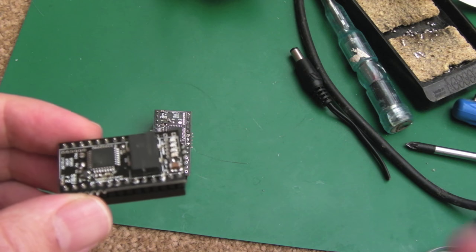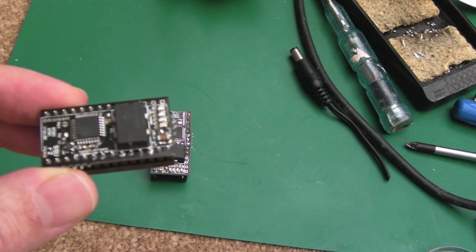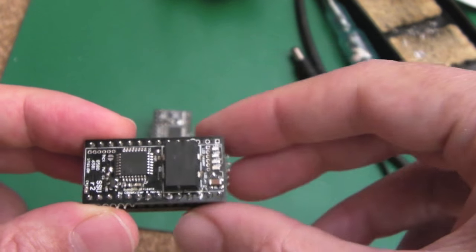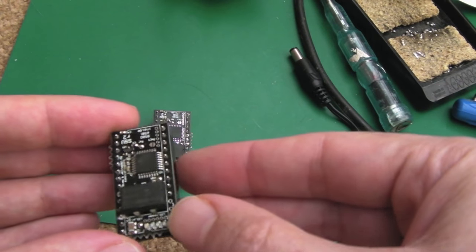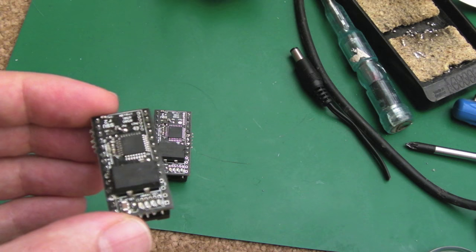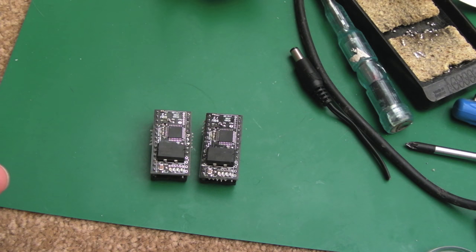And as I say, I've got to thank ilesj for pointing out some of the differences here. But in particular, the lack of readable oscillator 3 and envelope 3 registers. Those were the reason why Alien didn't sound quite right, and R-Type. I suspected that at the time when I did some tinkering with my Nano SwinSIDs. I suspected that some of the registers were not being read properly, or there was no facility to read them. That blog has confirmed that.